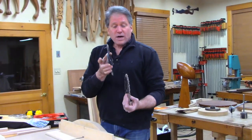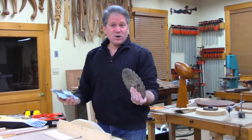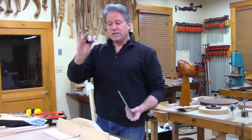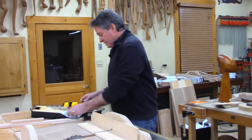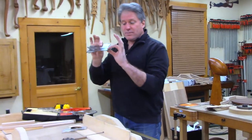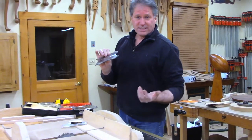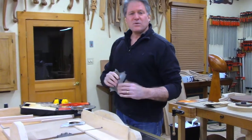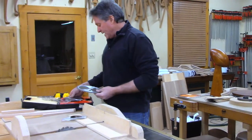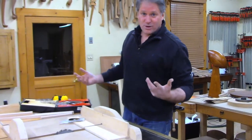And after you put all of those together, four inside, you get 3/4 of an inch thick. Then you can adjust for thickness with these micro shims, which usually come in a pack. They also give you a couple of extra insert pieces that aren't the eighth inch. I think one's a 32nd or a 16th, and the other might be 3/32nds. When you need to find some point between that, because plywood isn't exactly 3/4 of an inch.